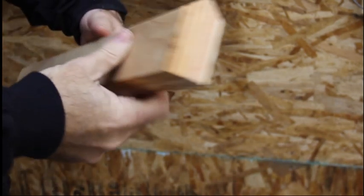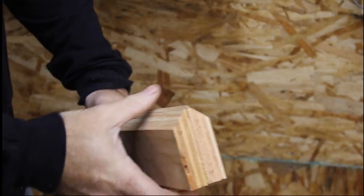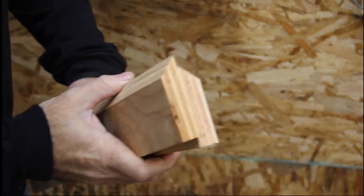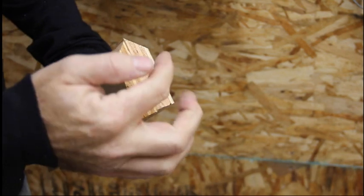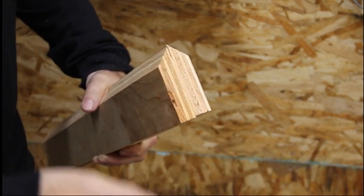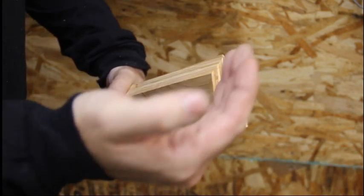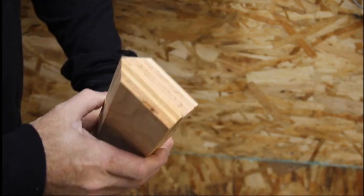As you can see, I now have two boards that are exactly the same length with opposing cleats on them. In a case where you want your tool cleat to be smaller and your wall cleat to be bigger, you could go with a one by four or a one by five and then only cut maybe an inch off of one side, offsetting it — not getting to the center. But that was just an example.